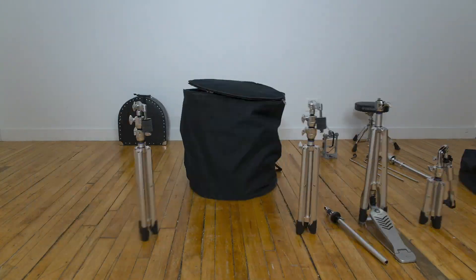When we looked at the lightweight hardware market, we asked ourselves how can we make this better? We got every piece of lightweight hardware we could in the market and stacked it up against prototypes. I made an angle chart to determine at what point a cymbal stand is going to topple over with a reasonably heavy cymbal on top. We put all stands at the same height, same cymbal on top, legs oriented the same way, and measured when each stand would fall. What we designed was a channel-shaped leg, an all-aluminum stand, built from the ground up — the lightest in the industry and by far the most stable.